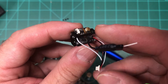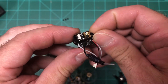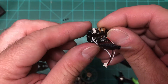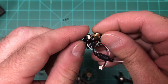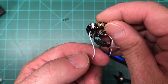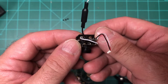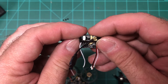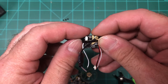A little addendum to this process — I didn't realize it until I was putting it together, but this bracket screws onto the canopy to hold the camera in. I didn't realize the white wire was going above it and it was pinching it pretty good. So I had to actually unsolder this from the flight controller to get the wire routed properly. Hopefully you'll see this step before you actually do it, but I wanted to throw that in there.